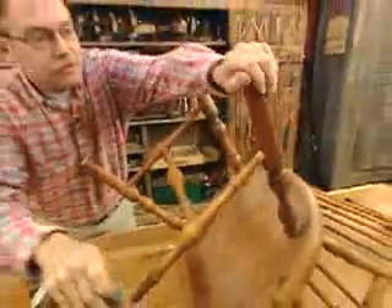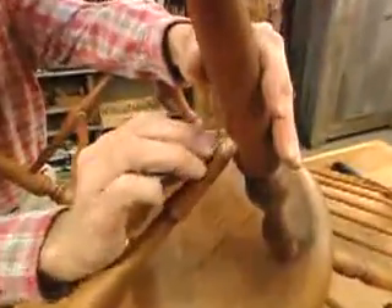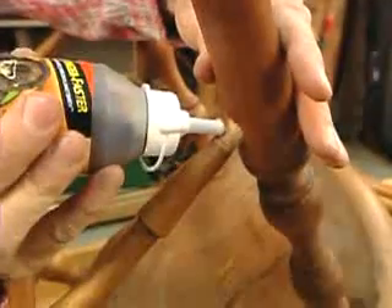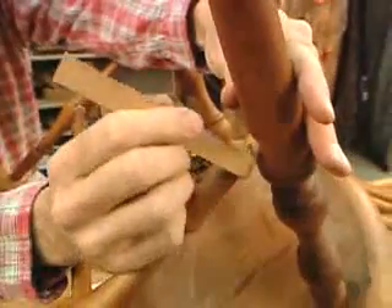The first thing is spread it as far as you can. Use a little bit of 100-grit sandpaper and rough up that surface. You don't have to get all the old glue off, because Gorilla Glue actually loves to bond with the other glues there. Quite frankly, it's the only glue I like to use for this job.